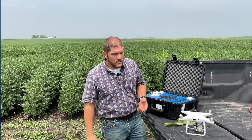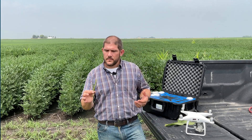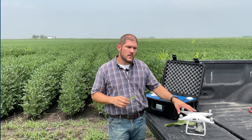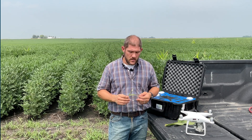Primarily we need to know what is the application we're trying to accomplish, whether that be a scouting mission, fertilizer application, or a plant stand analysis. For plant stand analysis, for example, we're going to have very small plants. These small plants are very hard to detect by multi-spectral sensors because they have lower resolution, but RGB sensors such as this one here, or other sensors coming on the market that are 50 and 60 megapixels, can easily detect these small plants from even 400 feet or 120 meters.